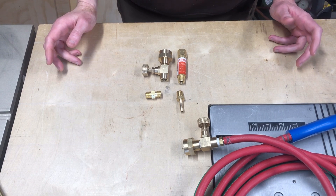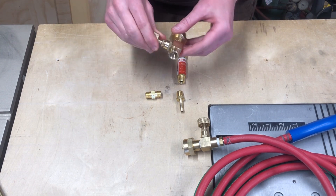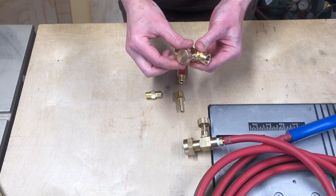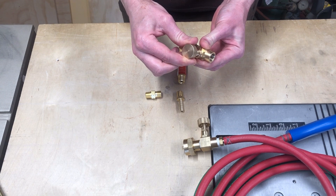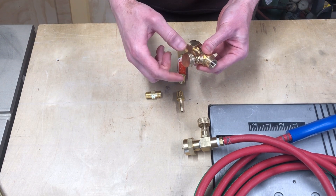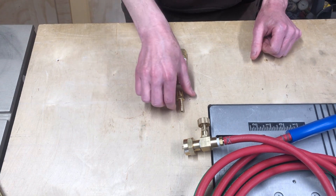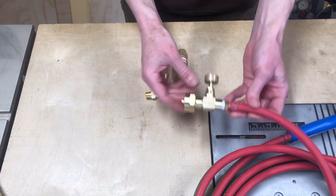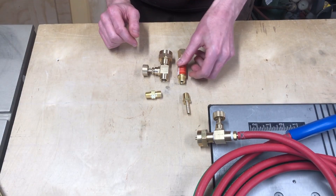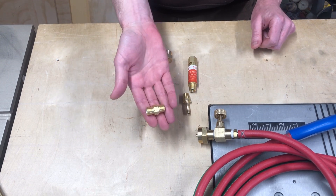Unlike the commercial products, with this system you get more options, most notably with the needle valve. The valve I am using has a low thread count needle — it requires only a quarter turn before releasing gas. You can choose a needle valve with a high thread count so you have to turn it multiple times before it releases fuel. You can also go with a hose barb, as I've done here and in my previous video. I'm adding a flashback arrestor to this system, which is why I'm switching from the hose barb to this fitting.